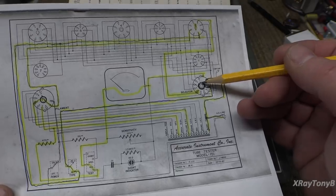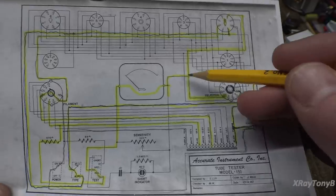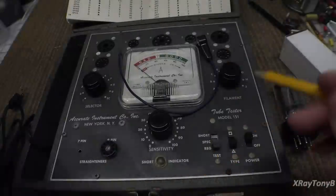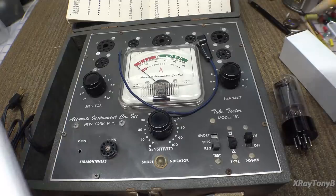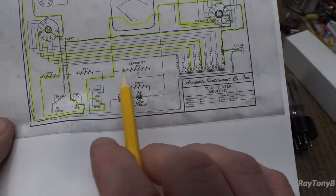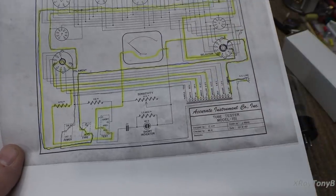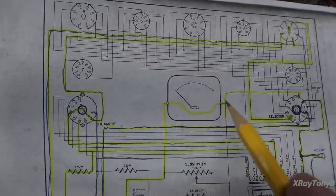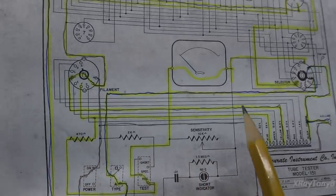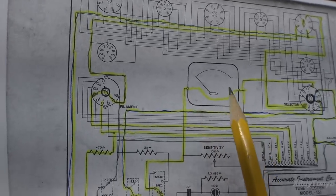That's going to take this center pin here and connect it to pin 5, taking it through the meter circuit. Then we're going to set the sensitivity to 35. You can see this is just a shunt — this resistor is a 10k pot that shunts across this meter. This meter doesn't have a current shunt in it; it's a very low current meter, microamps I think. So this actually acts as your shunt. That's why I put that 10k resistor in series with my Fluke meter, because my meter is very low resistance unlike this one.